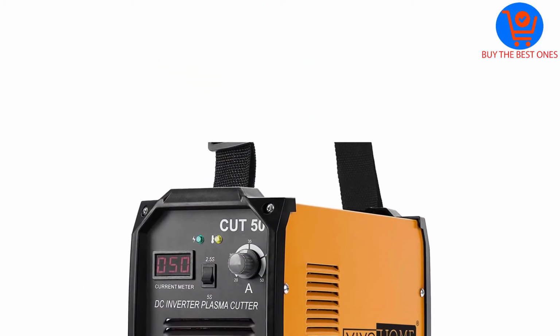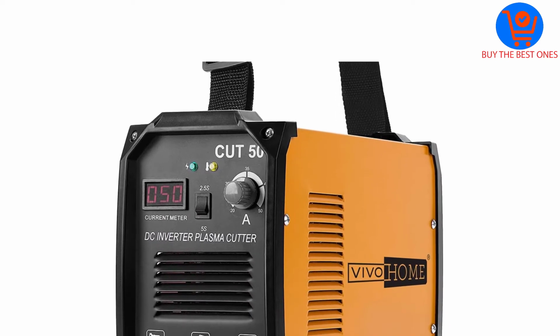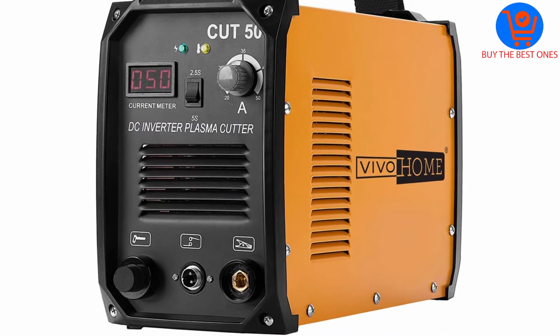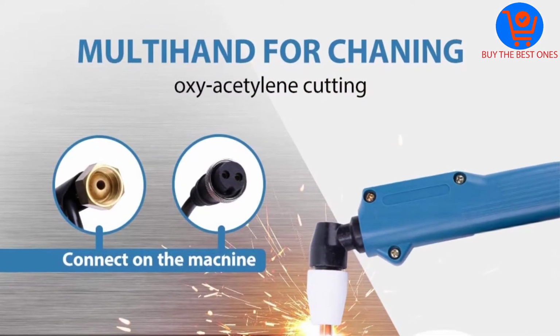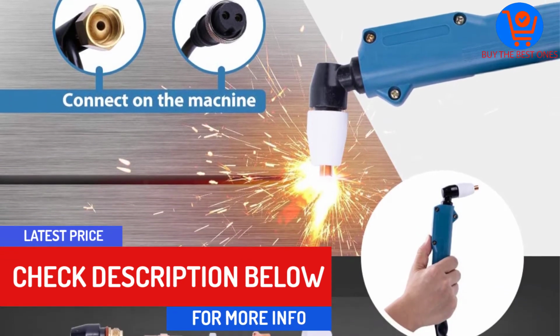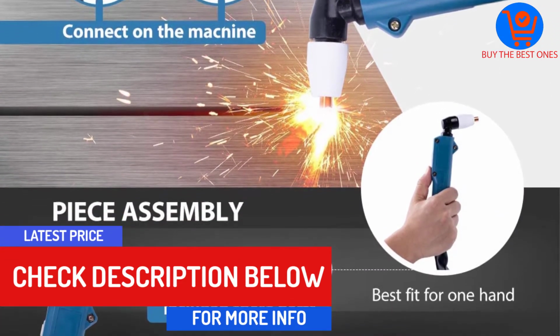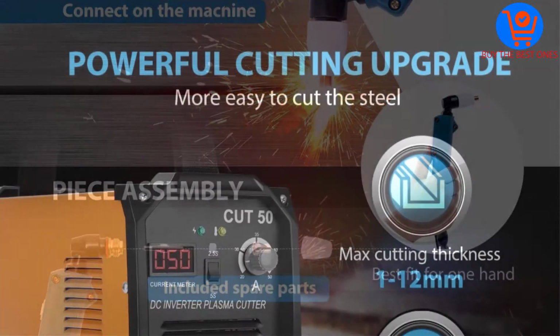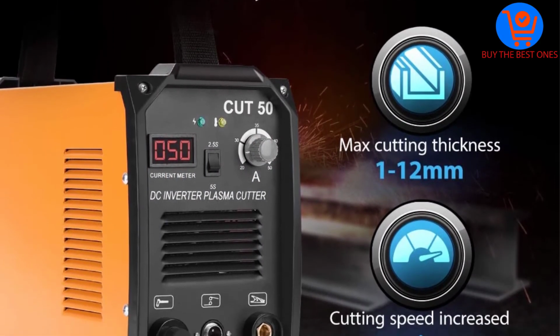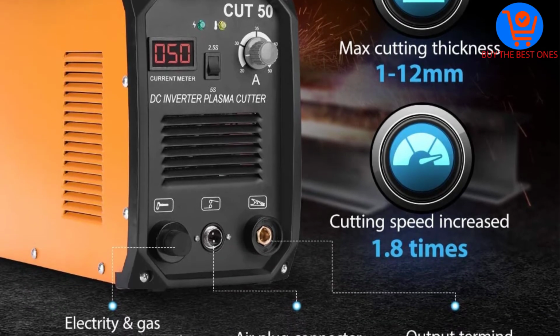However, keep in mind that the duty cycle isn't rated and there's no temperature indicator light. So, you'll need to be very careful about not overworking the unit. The cutter comes with almost everything you need to start working, including a welding face mask and goggles for safety. However, there is one necessary component missing: there's no tubing to connect from the air input to your air compressor.